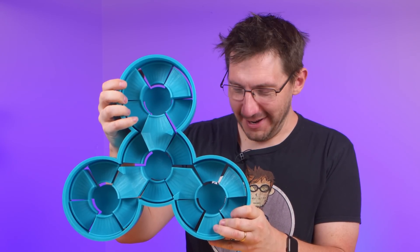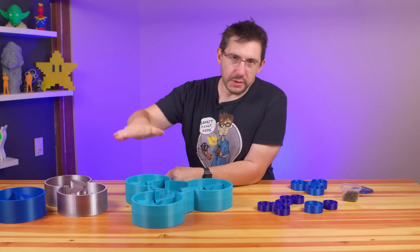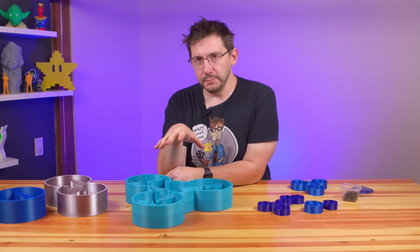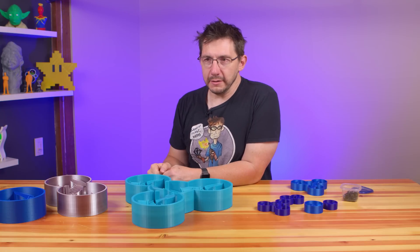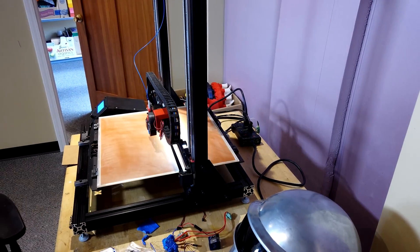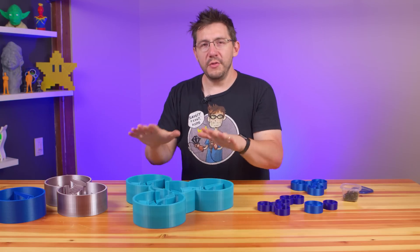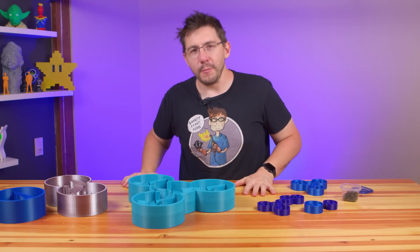There's the High Five Blue on the bottom and then Maker Geeks filament. Getting it off the build plate wasn't too bad. Originally the G max 2 has pristine PEI on the heated build plate but it wasn't grabbing the filament enough. My buddy Dave suggested lightly sanding fresh PEI with 220 grit or above, so I did that, wiped it with isopropyl alcohol, and added a few drops of Vision Miner's Nano Polymer Adhesive for extra stick. Here it is: 330% four-lobe golf ball kaleidoscope!